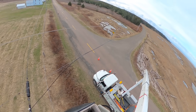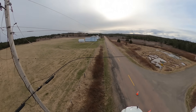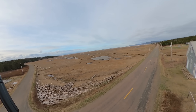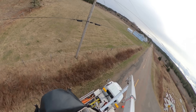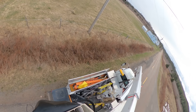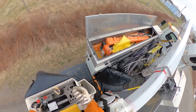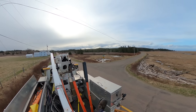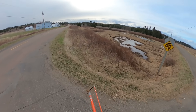The scene is now pretty safe. If a car drove by and went over that wire, it's not connected to anything, it's laying flat on the ground, and it is grounded. The worst hazard at this point would be if it got tangled in a wheel well and yanked at the pole. One thing I might have done differently — this footage is from a while ago — would have been to completely cone the road off before even going up in the air, in case a car came by.